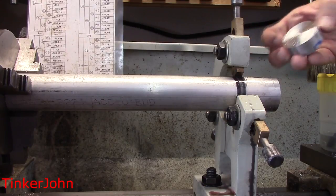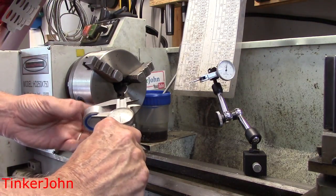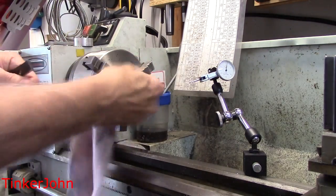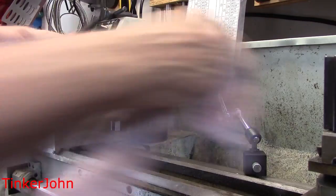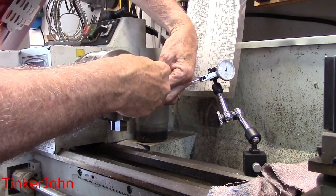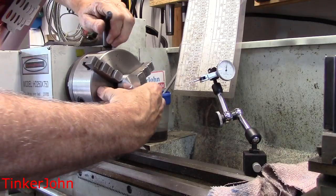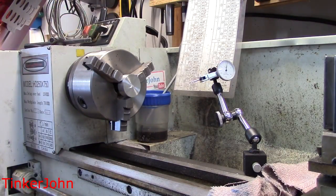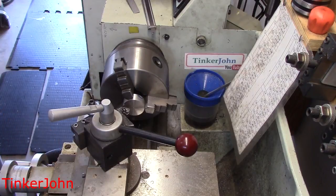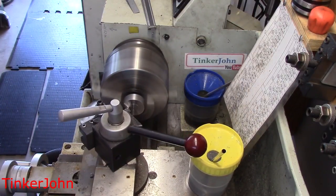Now I've put a little blue on one end of that — I've got a blue side and I'm going to put a red side on it. I'm just checking the thickness and making sure I've got consistent thickness all the way around — you want that to be pretty close, within a thousandth or so. This is the cutoff side — the side that came off with the cutoff blade. So now I'm facing it to get it as flat as possible. I'm using some parallels in the jaw to get that right, making sure everything is good and tight. I want a pretty good finish on it. I'm using the dial indicator to make sure everything is running true in the three-jaw chuck. I'm facing this side because it's actually going to be down or attached to the cylinder — it's also where all the valves will be, and this will be where the layout will be done from.